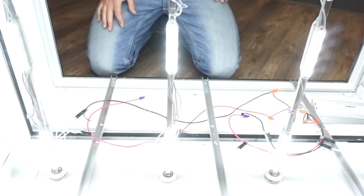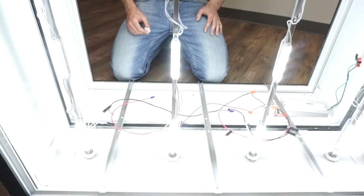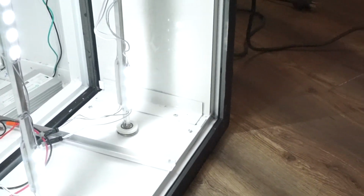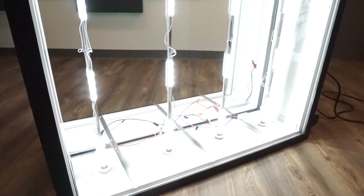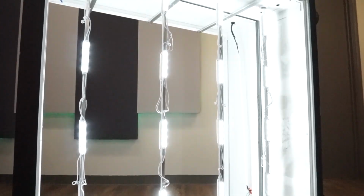And that'll do it. Additionally, we do recommend that for just good housekeeping on your wires, using either some zip ties or some of these wire holders themselves along the bottom of the sign, just to prevent any shadowing. And once more, ensure that once you're done, to cap off the end of any of your spare lead wires or your 12-gauge lead wires, so that there's no water intrusion at the ends wherever cuts are made.